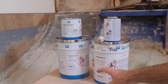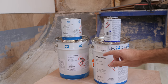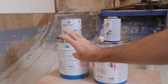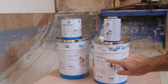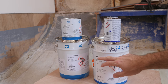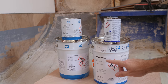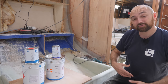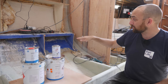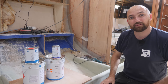This is the paint I'll be using inside the boat — it's pretty much the same stuff as I've used on the outside, but the top coat is a little bit different. The primer, Sigma Cover 280, is the same two-part epoxy primer. And then this is Sigma Duo 520, which is a two-component polyurethane — I used 550 on the outside of the hull. The 520 is supposedly not as glossy as the 550. The reason I'm painting the inside of the hull is more for appearance, not really for protection, except for the areas where it's exposed plywood — those areas I want to seal up, and for that the two-part epoxy primer should be a good choice.